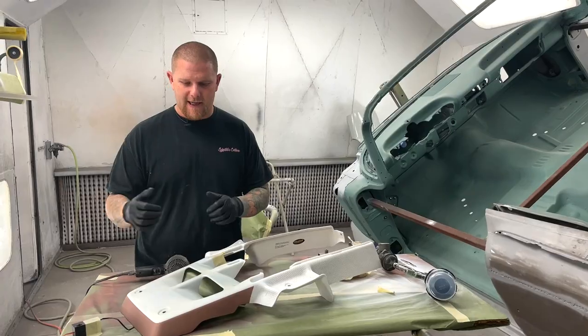We're going to turn the inverter on and see how much of this lights up. Interestingly, none of it lights. I might have to go over the bus bar a little bit. I was in the daylight putting the conductive top coat on but I never went over the area of the bus bar. As soon as I get the top coat over the bus bar and dry it, it's going to start lighting. You have to treat this like an electrical circuit, not paint.